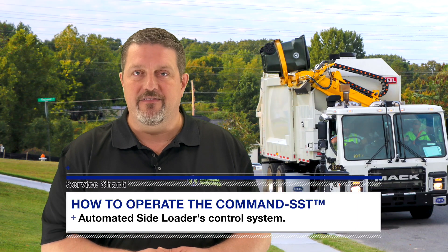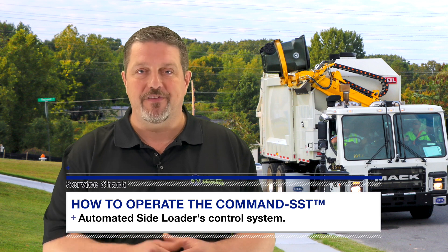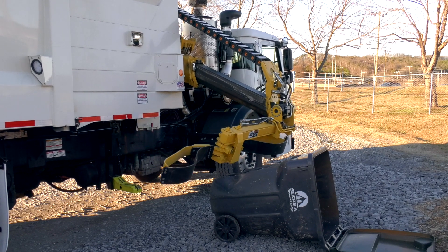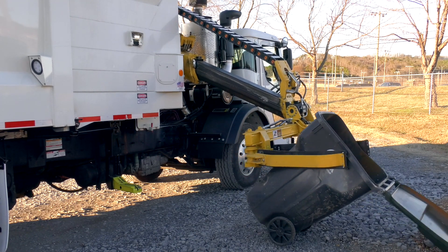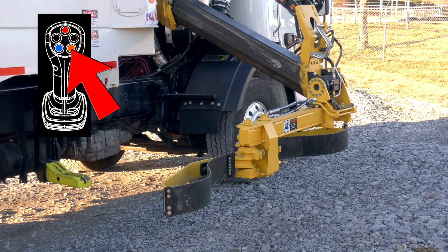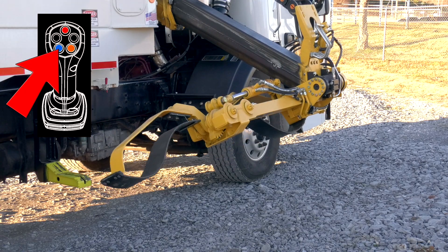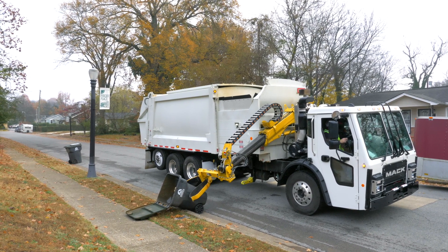Now, let's say you've got a can that was knocked down — normally you'd have to get out of the truck to stand it back up. Now you can do all of this while remaining safely in the cabin. After moving your grabber head out of the stowed position, use the blue and orange push button functions to adjust the grabber head pick height and pick angle and move into the best position to grab and pick up the can. For cans that are more difficult to reach, use the activate head rotation function: press and hold the red push button for five seconds to freely rotate the lift arm's grabber head. Press the orange push button to rotate the grabber head up, or the blue push button to rotate it down. Then move your lift arm into the best position to grab the can and rotate it back to the upright position using the blue and orange push buttons.